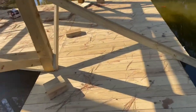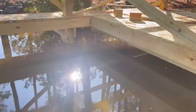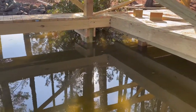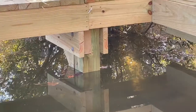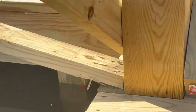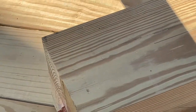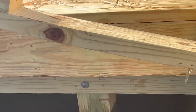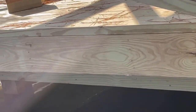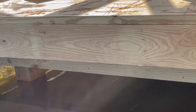You can see here in the slip that I have what are called girders supporting the joists. These girders are bolted to the poles. The joists sit directly on top of the girders and provide the support that the deck needs. This is just a cap board on the end — a rim joist — so you can see the joists right there; these are two-bay joists and two-bay girders for this particular boat.